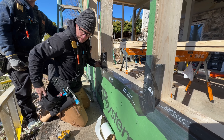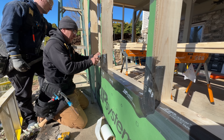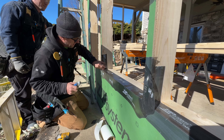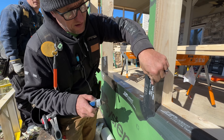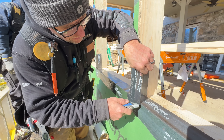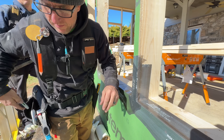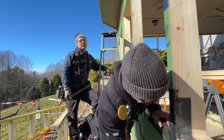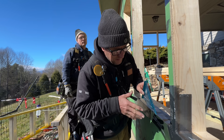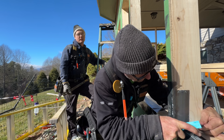I cut this excess off just because I didn't want it to be doubled up. Yeah, that's probably a good idea. This is kind of a unique situation where we have two window openings that kind of overlap like that. Might even bust all those flanges. So they fit in there — I'm thinking just put them where they go, and they just make one cut. Run the nails right in the crack.